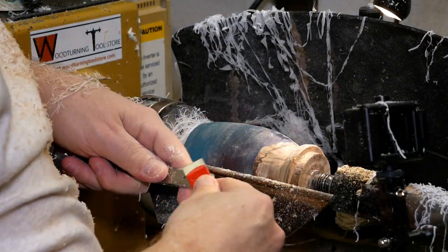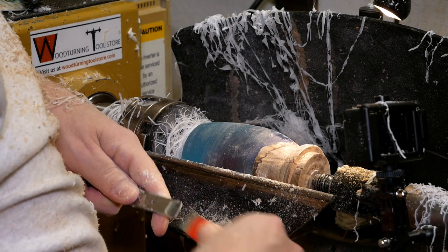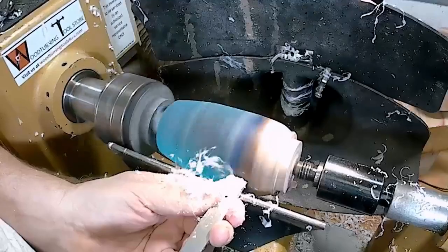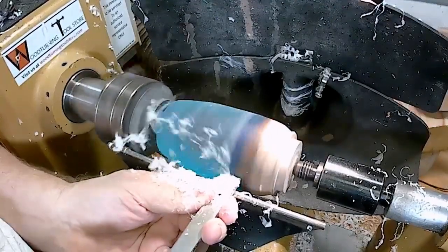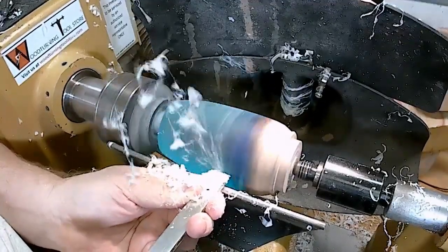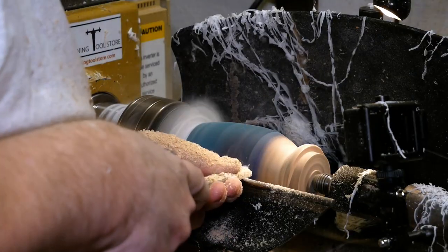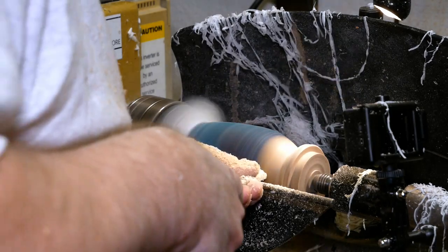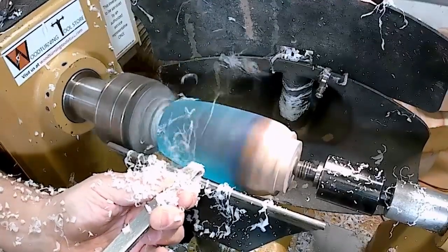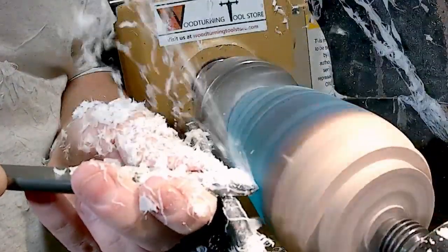This kind of cutting certainly dulls tools, so I'm using a hone to re-hone or sharpen the negative rake scraper — first on the top edge, and now on the bottom edge — trying to create a little bit of a burr. You can see in the slow-mo that it works fairly well. You can see the shaping action: I hold the tool tight to my body and move and pivot my body around. Some nice slow-motion action, and then we get a nice side view showing that negative rake scraper.